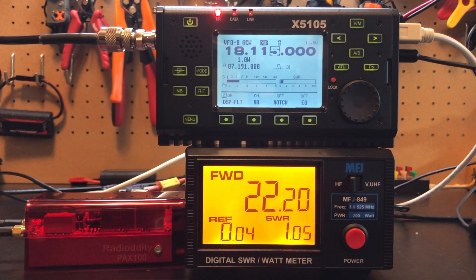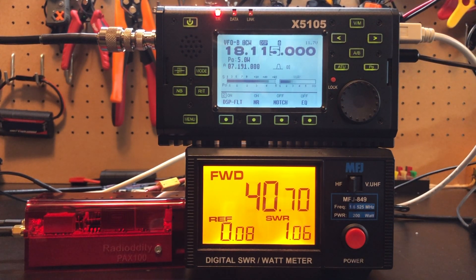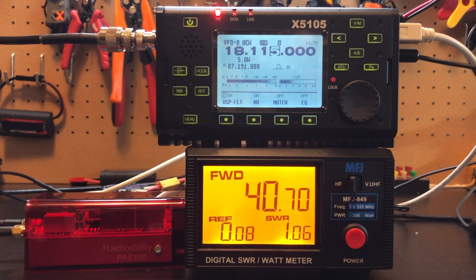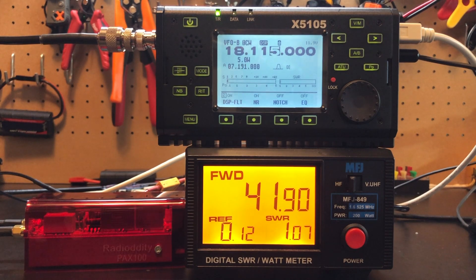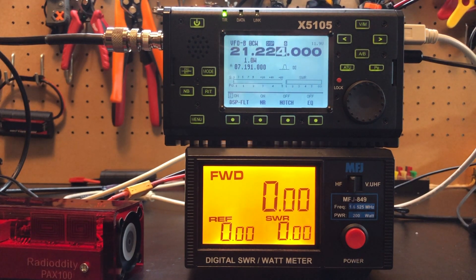Here's a look at 17 meters at 1 watt — 21, 22 watts out. Let's see what 5 watts gets us. This thing's freaking out — I don't know what it's doing. Look at the SWR — not very consistent. Something's not happy. You can see the meter is seeing a perfect SWR into the dummy load, but the amplifier sure isn't. Not sure what's up with that. Let's take a look at 15 meters — yeah, we're getting that SWR issue again. I wonder if it does it with the G90. Not happy with the X5105 though — even at only 1 watt, the SWR is just freaking out.